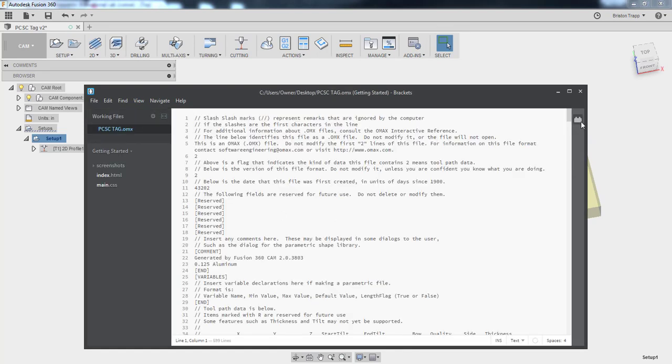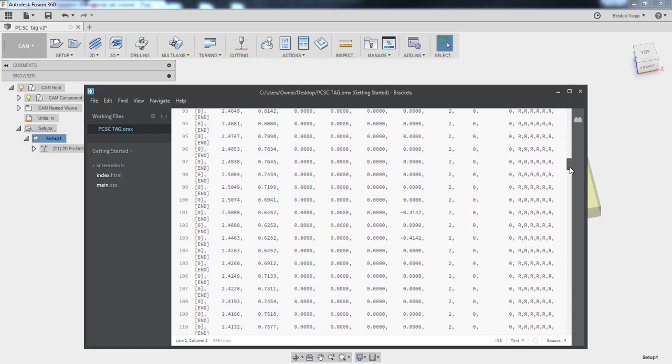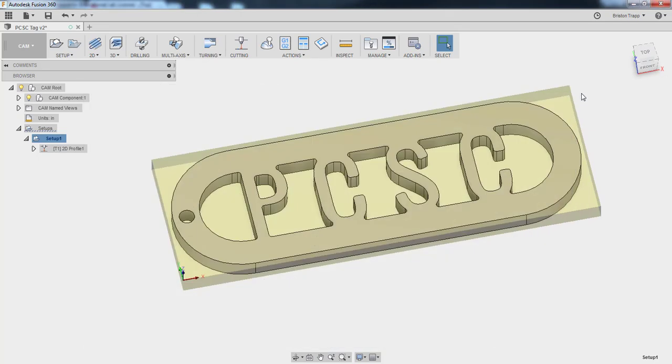And the G code for the OMAX, or the file that gets read in the Make software, looks very different than anything made for the mills or routers or plasma cutter. Click close, and that is it in Autodesk Fusion 360 for programming your flat 2D sheet metal part, or composites part, or wood, or plastic, or basically anything that can get cut on the water jet.